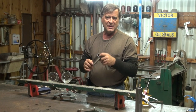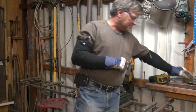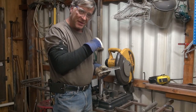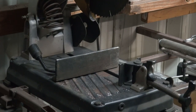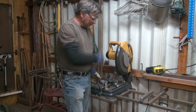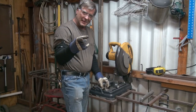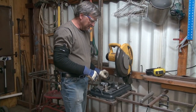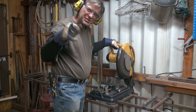What I do is take a couple of pieces and go over to the chop saw. One thing I'm getting into the habit of: anytime I come to the chop saw, I always get out a framing square. If I'm making a 90-degree cut on a piece of metal, I always check right up against the backstop, right against the blade, to make sure it's set at 90 degrees before I cut. Once you've got a nice square corner, your backstop 90 degrees to your blade, just throw your stock in there, figure out how much to cut off, and tighten it up — just a little snug, it's not going anywhere. Don't forget your glasses and hearing protection. Just go ahead and cut it off.